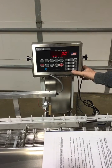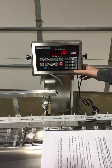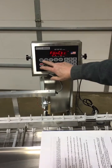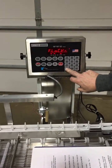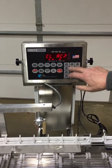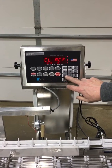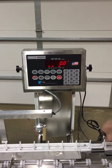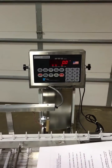And then we're back in weighing mode. Now if we want to zero all the flocks at once, press the asterisk followed by the zero button, then press enter. It will ask us if we want to clear all counts — press yes and enter. All counts and all accumulations are cleared after that operation.